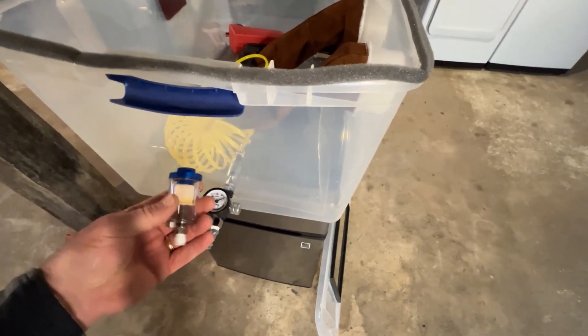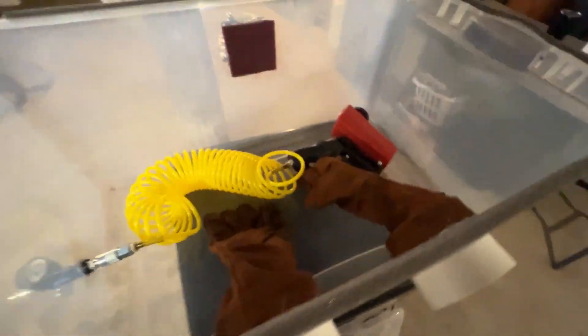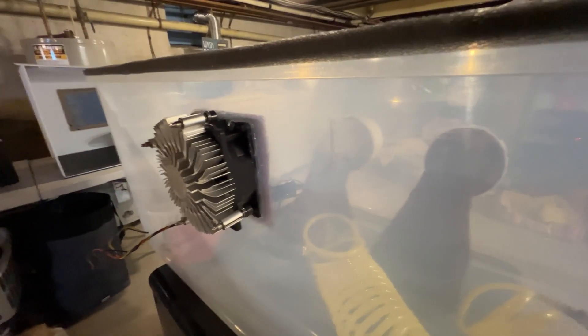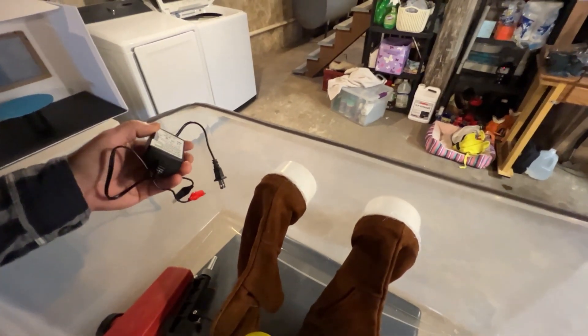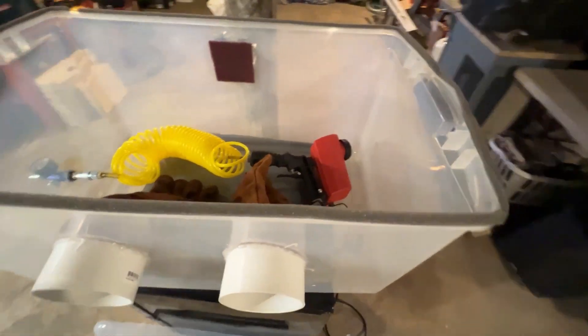This is a moisture evaporator to keep any moisture out because I will be blasting with baking soda. And then on the back here, that is just another one of those maroon Scotch-Brite pads and a PC fan out of an old computer. To power it, I'm just going to use one of these 12-volt wall adapters - connect the ground and hot to the red and black wires of the PC fan. I'm going to do a more extensive video on the build and we're going to give it a shot.